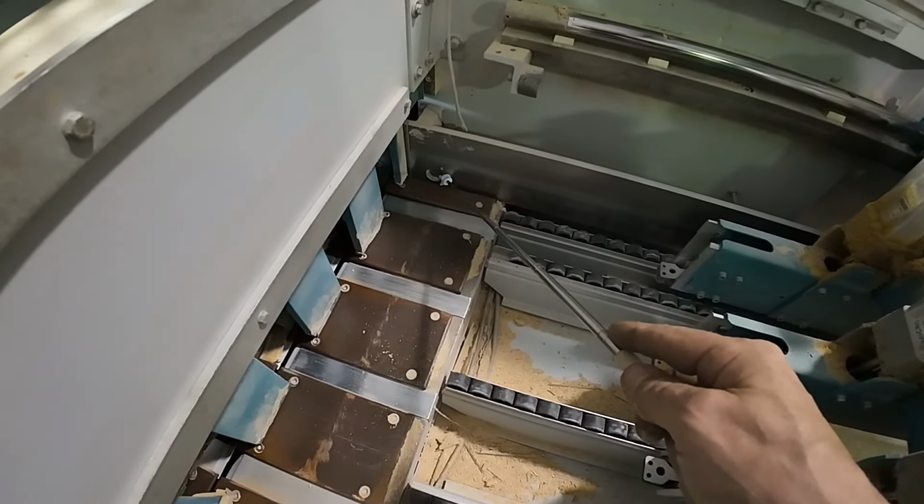So what happened was, this side aligner stroked over, got on that side of my panel because it had too short of a panel in it, continued going past the edge on the other side, so as the pusher started to move the material forward, it grabbed this side of your side aligner, and the rest is history.